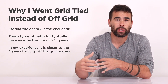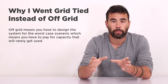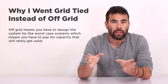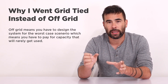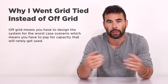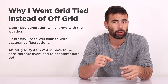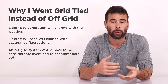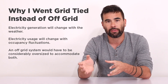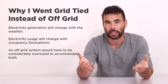There are a lot of battery options on the market, but to truly be full-time off the grid you need to rely on that battery bank for everything. That means you have to size it big enough to handle the worst weather you might expect every 10 to 20 years. The inherent inefficiency is that you have to size everything for the worst-case scenario but pay for that infrastructure all the time. You also have to think about when your demand might be higher than normal — if you have house guests over for the holidays, you might not have enough capacity. If you size your system for those unusual situations, you end up with a really big system that on an average day you're not using to its full capacity.